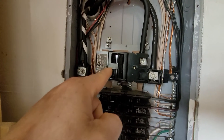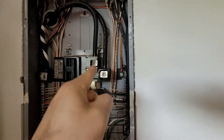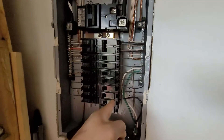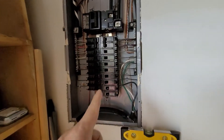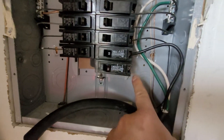Below the 250 amp breaker it's ready — that one is live, never touch that one guys. That one is 120 and 120 on this side, 120 and 120 — that's 240 volt if you touch that. Don't do it guys. Now I'm wiring the 50 amps on this breaker as you can see.